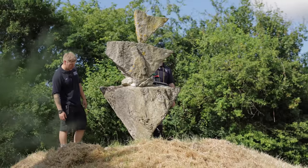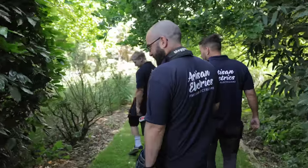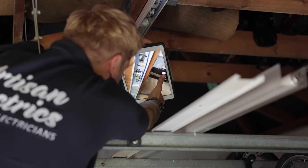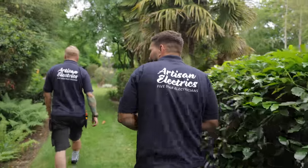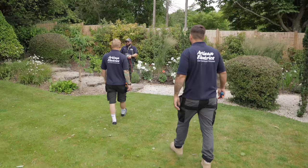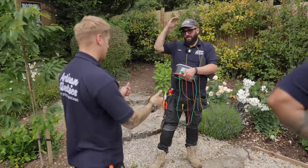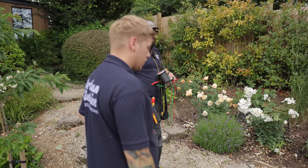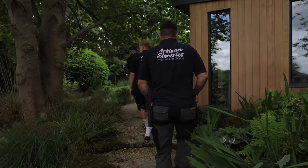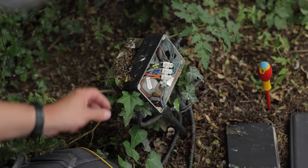There's a pole in the middle and it goes through — there's a mix of 12 volt and mains voltage. I'm getting 500 ohms at that box so there must be some transformers somewhere. That plug over there has got wagos and stuff in it but it literally just clips the lid off. That one's full of gunk as well, so I can see why it's tripping — that's probably why it's off. We've also lost the earth down here because there's no link between the armouring.